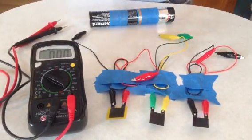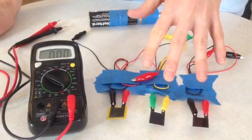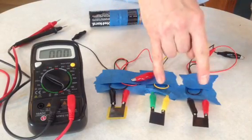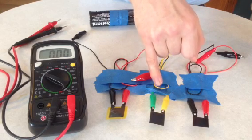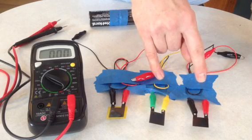I've assembled three different supercapacitors from the graphite that I burned from the LightScribe. Two of them are PVA — polyvinyl alcohol — and one is polyvinyl acetate, which is just Elmer's glue. Both of them are mixed with phosphoric acid at an 85% concentration.